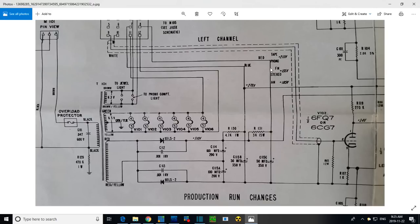So I think what we're seeing here is, as you turn on more and more of the receiver and draw more and more current out of the power supply, you get a bigger and bigger drop on this resistor, and you get these lower and lower voltages. So with FM, you got the whole thing rocking, and there's only 135 volts pressure left because of the current draw and the drop on this resistor. I think that's what that's about. It raises an interesting question about what is it that this can power that can afford to have these different voltages on it. Meanwhile, this line is powering some other tubes, I suppose, at a very, very steady voltage. Almost as if maybe they had to do 2 things here because they knew one of them would be doing this. And they couldn't let these variations occur throughout the receiver, so they created a second power supply line that would be kept clean of this effect. That's my guess. I don't really know.